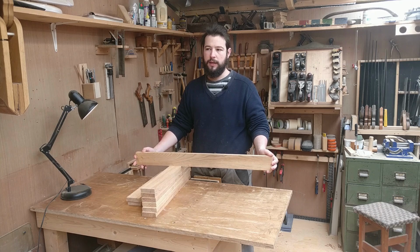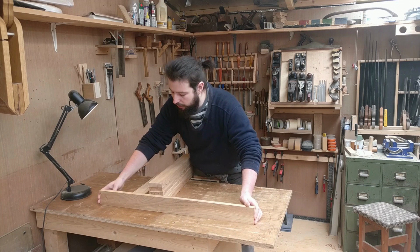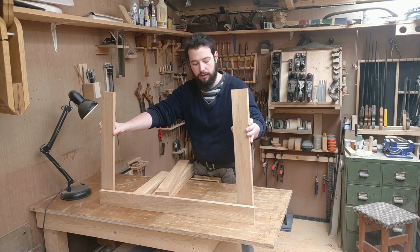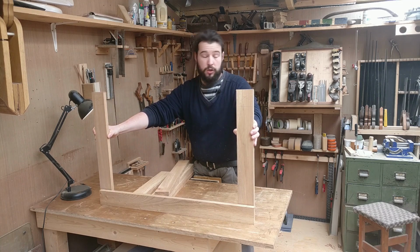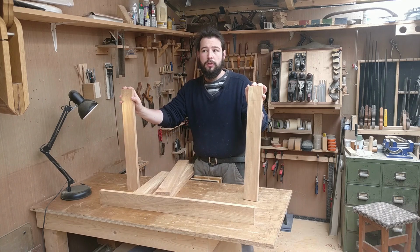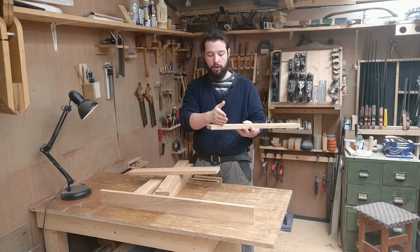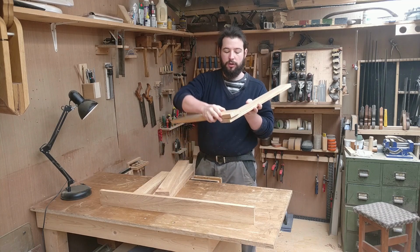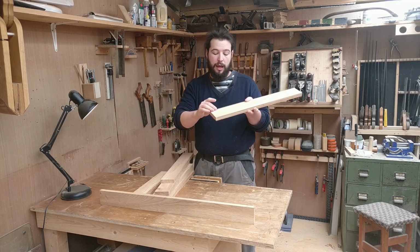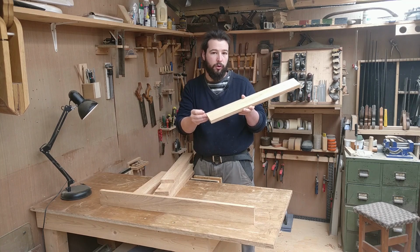are visible from the outside as full length. So what I mean by that will be my rear rail. These will be my verticals, and the verticals will be lapped behind. I should say, of course, the joinery I will be doing is half lap. So what that means is I will take this and I will cut off a piece, the correct width of the adjoining piece, and half of the thickness. That's why it's a half lap joint.